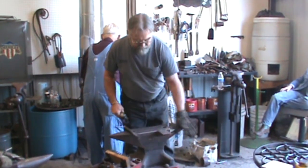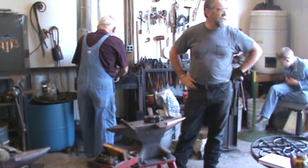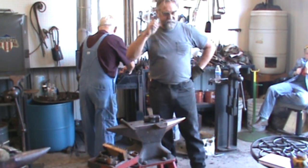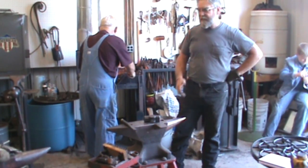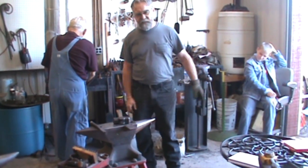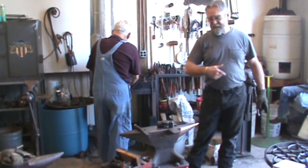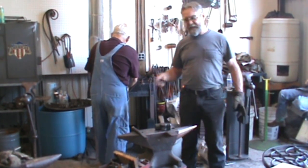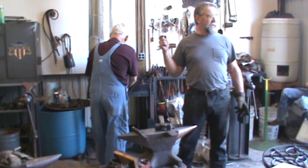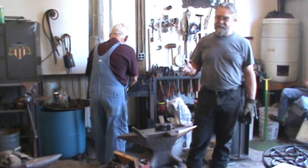Back when Ernie Drill demoed, he was using S7 for all of his chasing tools and all that. Somebody asked him about annealing it, and he said it can't be done unless you've got a special heat treat oven. Clay Spencer even spoke up and said yes, you've got to hold this heat for so long. So, of course, I took that as a challenge. I went home and was going to make some rounded chisels like he was making. So I forged them out first. Of course, I couldn't file them. So at the end of the day, I put them in my gas forge and got them blistering hot, shut the door, cut it off, and went home. And the next morning, I could file them. And that was that set.